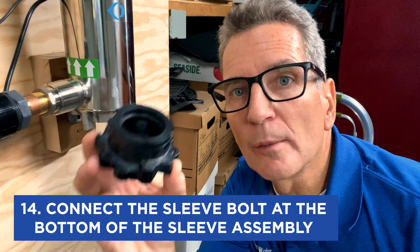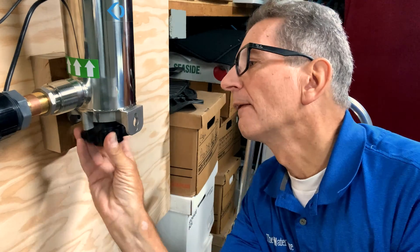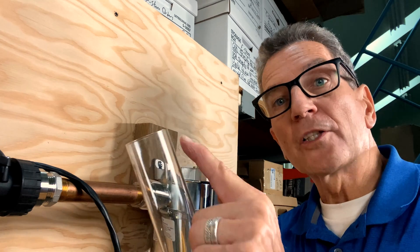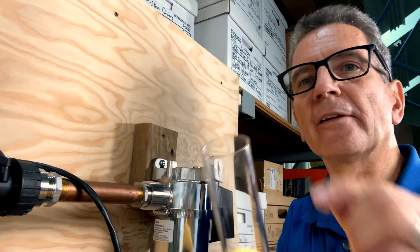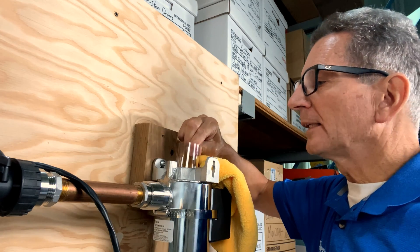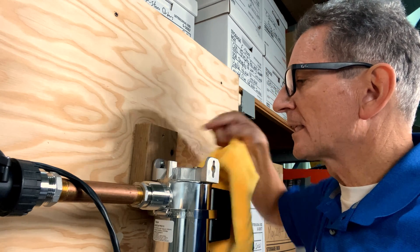To replace the sleeve, start with the bottom bolt. Keep in mind there's a hole inside that must line up on the right-hand side — opposite the inlet and outlet. Start with it facing you, then turn it 90 degrees so it lines up. There's no o-ring in here yet. Grab the sleeve and watch for the etching with an arrow pointing up — that side goes up. If you can't find it, the tapered end goes down. Feed the sleeve through, handling it with a cloth — no fingerprints. Slide it all the way down; you'll feel it seat in a couple of stages until it's fully in.